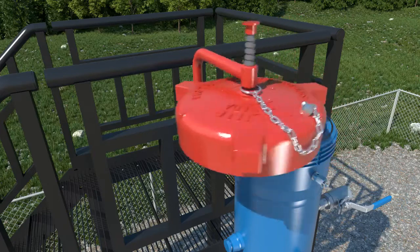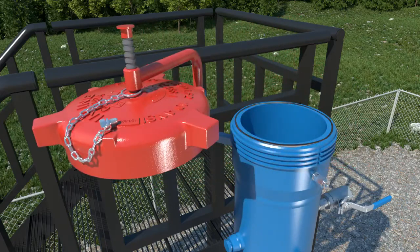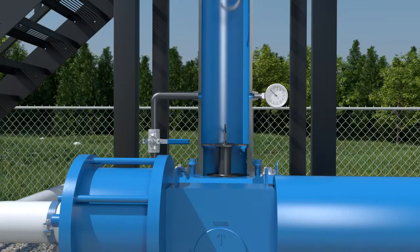Lever the cap off the barrel and swing it aside. Use the retrieval rod Argus provided to remove the pig weight. The pig weight assists in the gravity feed of the pigs into the ball core and ensures that the last pig does not take on buoyancy, making sure it stays in its proper position.